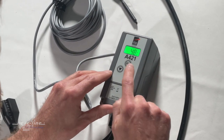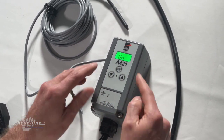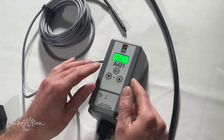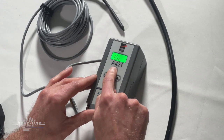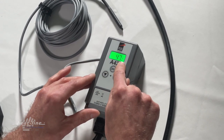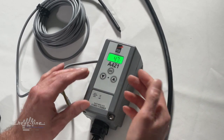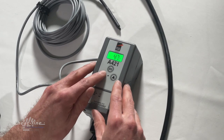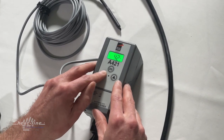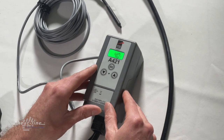I'm going to press the menu button one more time. Now we have flashing 'on' — this is what we did not have before because the keypad was locked out. Pressing the menu button one more time gives us the flashing temperature for the on temperature. Let's change this — let's take it down to 40 degrees. So the on temperature is now set to 40 degrees.